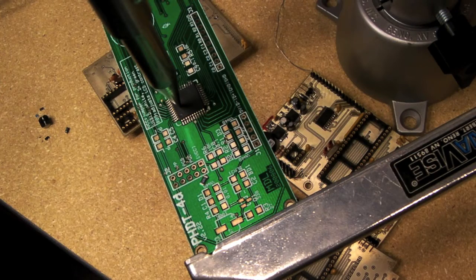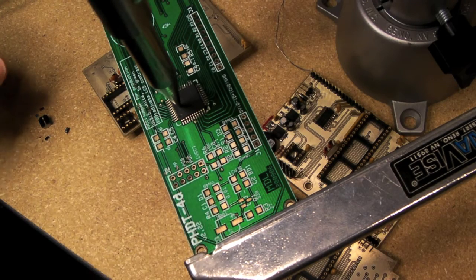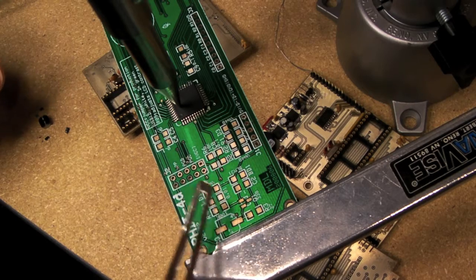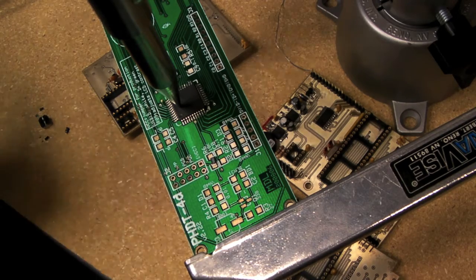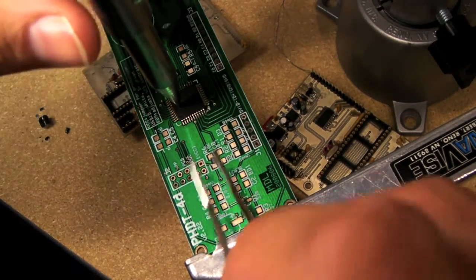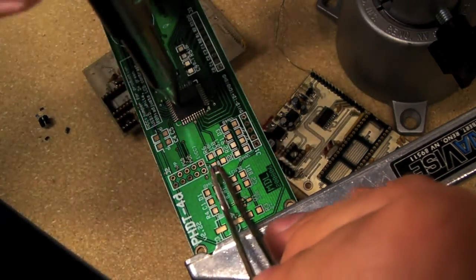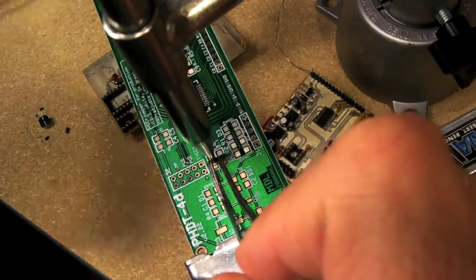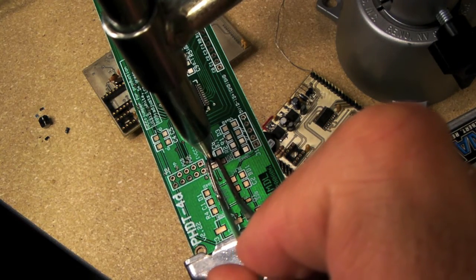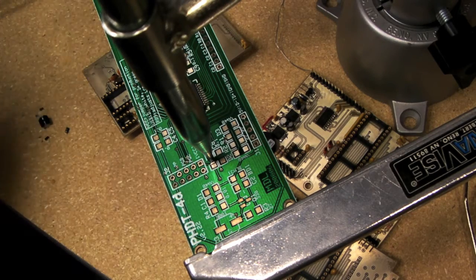Okay, what I'm going to do here is try to solder a few parts onto the board. I've already got a little resistor here, and I'm going to solder it right here. These may not actually be the right spot for this particular board, but I'm going to use this as an example. So the first thing you do is you grab the part with your tweezers like this, and then you move the Stinger over to the top of it like that, and then use your tweezers to place the part, and you can accurately place it where it needs to go.